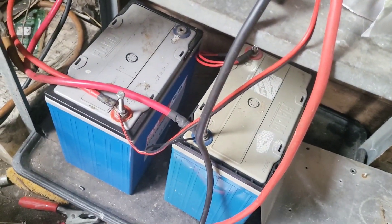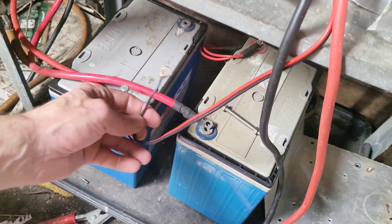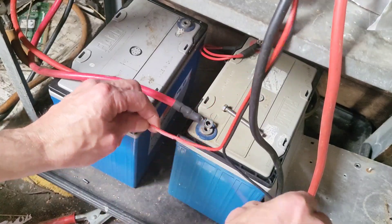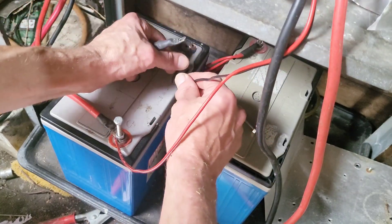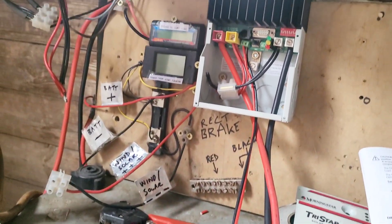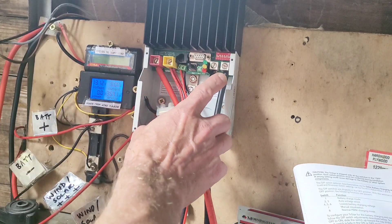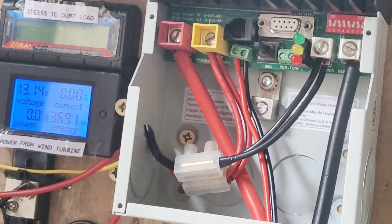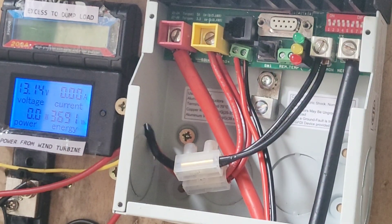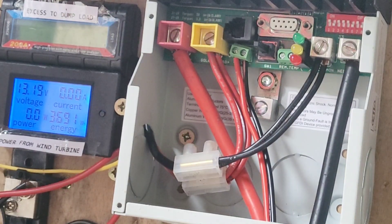So we're gonna get rid of that. Now the meter's gone off, we're gonna disconnect this. The smaller cable here is the battery sense cable which goes to the controller, so we need to make sure that fits over there — which is a bit of a squeeze but it does. I'm just gonna concentrate on the meter for a second because when that comes on it should say 14 volts, or thereabouts, maybe 13. That's been changed and we're getting an approximately right reading.